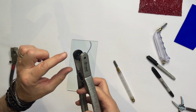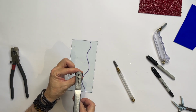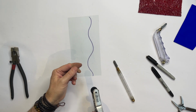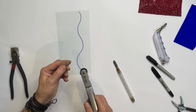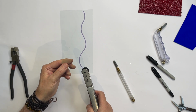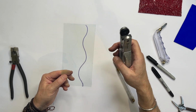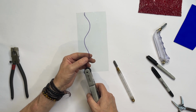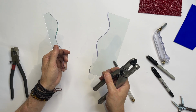So you have your box pad on top and your circular pad underneath, and you have the box pad sitting at right angles to the direction of the line, and you center it just where the score line is, and you gently squeeze down and you'll hear the glass beginning to crack. There we go. So it started its process along the line, and we go to the other side and we carry on. We encourage it at the other side. And there we have it, broken in two.